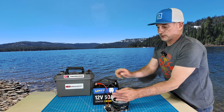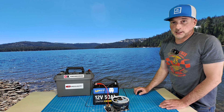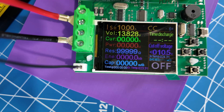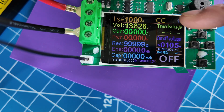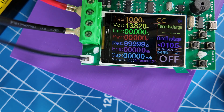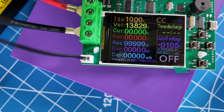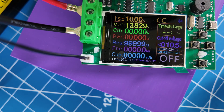I also have this external temperature probe that I'm going to tape on the side of the battery pack where I can feel it's nice and solid and the cells are. We'll see how hot it gets during this load test. Looking at the tester: the load is set to 10 amps constant current, the voltage will vary and drop with more load. The cutoff is very important — I have that set to 10.5 volts. You do not want to go too low; you can damage your battery. So let's go ahead and hit start.